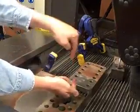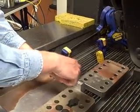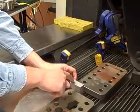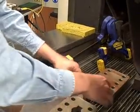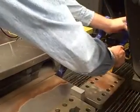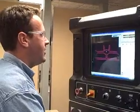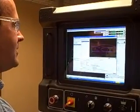The way I'm going to reposition this is I'm going to turn it 90 degrees counterclockwise. The reason is the top here is going to be the tail of my jet because this is where the jet was best cutting. So I'm just going to rotate, and my second profile — the side profile — the tail is going to be back here, so it'll have really good detail on that tail. When I'm happy, I'm going to make sure that the material is up against my square apparatus, push my holding apparatus back into place, put on a clamp, and make sure that's really tight. You don't want your piece moving as it's cutting, obviously.